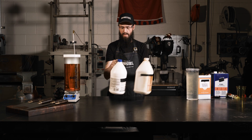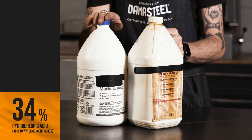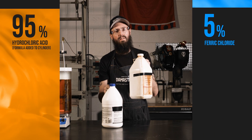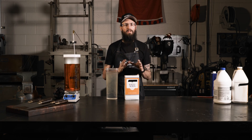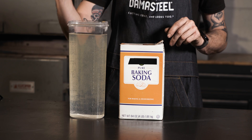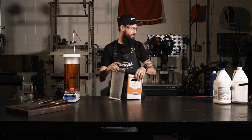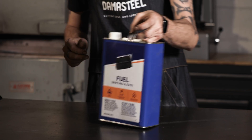Next, we fill that up with a blend of hydrochloric acid — this is a 34% mixture. We've already added 95% of this blend, and we're adding 5% ferric chloride. Next, make sure you have plenty of baking soda around. This is really important for cleaning up any spills and for neutralizing. I also like to have a bath of water here with about one cup of baking soda in it — that's what we'll dip our knife into and stir around after the etch to make sure everything is neutralized. You'll also want denatured alcohol handy to clean the steel, because we want it completely free of any contamination before going into the acid.